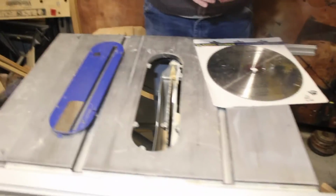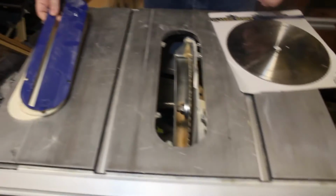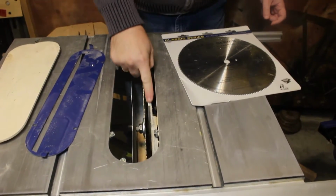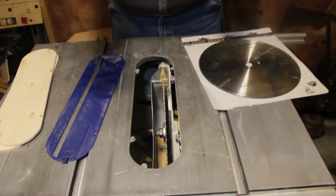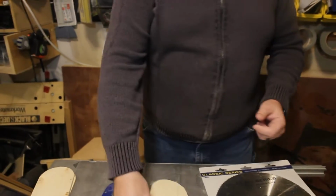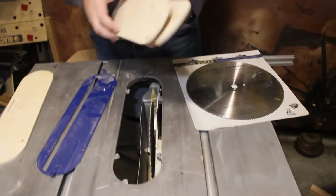Now, and this is not just for this saw, but I'm working on making custom plates. And you simply use the existing plate as a template. But this saw, because it has this high point here, which I really don't understand why it has it, requires you to take some wood from the underside in order to fit. So it's a little harder than many other saws to create a plate, but of course not impossible.